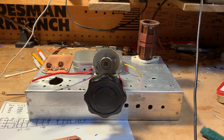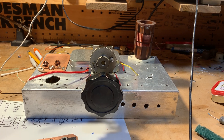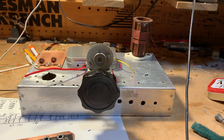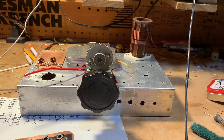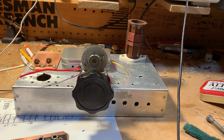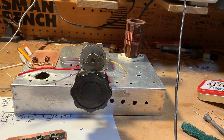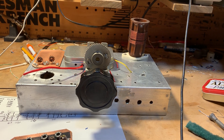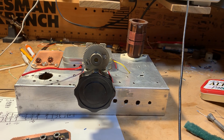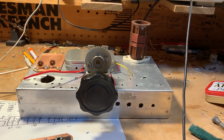The bandpass filter is very important for a receiver like this because the IF frequency is 455 kc, and normally they don't recommend using an IF that low above 7 megahertz because you get into image frequency problems. It's hard to build a bandpass filter narrow enough to knock down image frequencies when the IF is low and the frequency starts getting high.